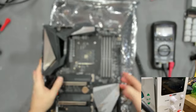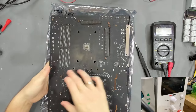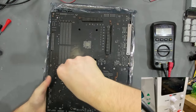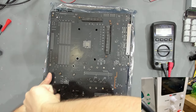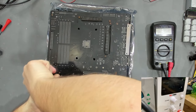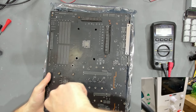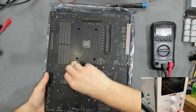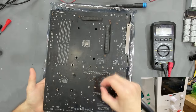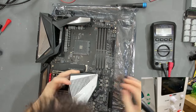Our Super I/O is behind this big heatsink which is also responsible for the PCH, so let's take this off as well. Always remember - never loosen the screw fully on the PCH because there's a lot of pressure applied. Start undoing them in a star pattern, and once they're a little bit undone you can screw them out fully. Best to hold it from the other side with your hand. This also has a connector that just pulls out.